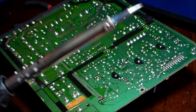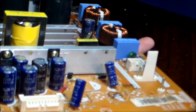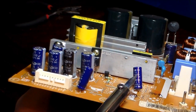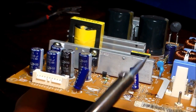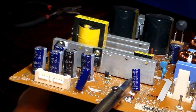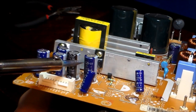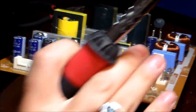Now that the circuit is discharged, locate the capacitors you want to check. These are pretty common to repair — these are 1,000 microfarads, 10 volt. So this can handle up to 10 volts going through the capacitor; any higher and it starts to swell and bulge. UF stands for microfarads. It should read give or take 10% of 1,000 microfarads using a capacitor meter. These others are 25 volt, 2,200 microfarads — that's the value of the capacitor.